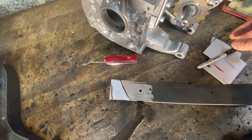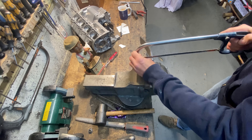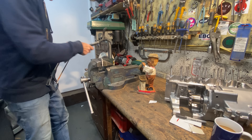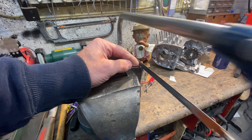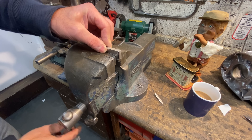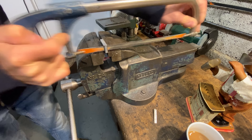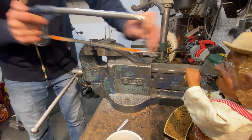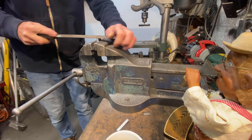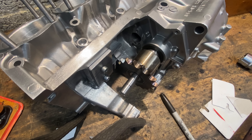This is 8mm thick mild steel strip, and I'll be cutting it with my hacksaw in the vise. I really enjoy making parts with hand tools, especially my hacksaw — it's so rewarding when you see the parts taking shape. Here I'm trimming off a sliver of metal to make it fit just right. I finish off using a file to remove any sharp edges, offer it up to the bracket, and it fits just right — I am really pleased.